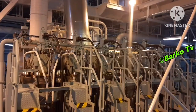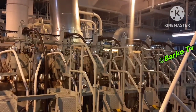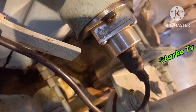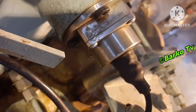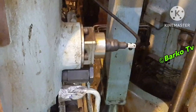Thanks for watching. I hope you now know how to determine whether the sensor is defective or not, and how to simulate it. Terminal 1 is positive, number 2 is negative — that is 24 volts. The output is terminals 3 and 4: 3 is positive and 4 is negative. I hope you learned from it.